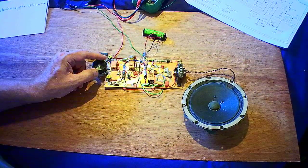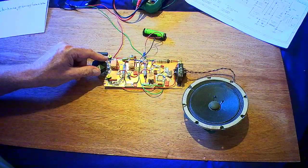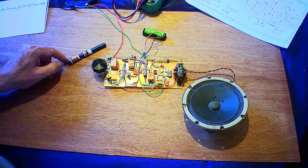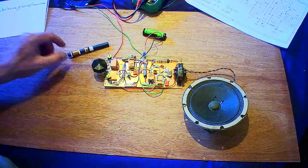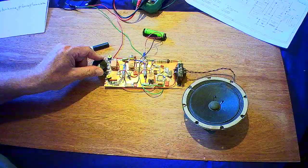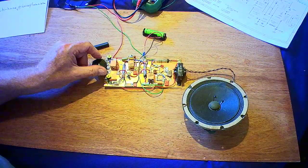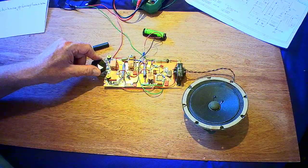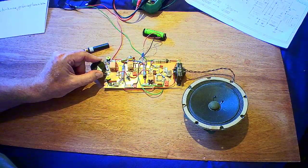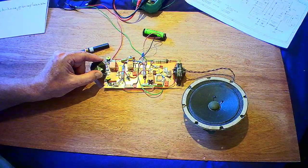So it does receive. It could certainly do with an external antenna, or a pickup coil on the ferrite rod to feed that through. Local station. Not a lot else. I know there's not a lot of medium wave nowadays. I think most of it is because it's not that sensitive. But there's about four stations it's picking up.